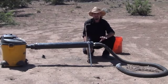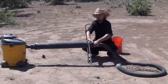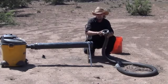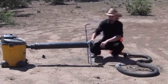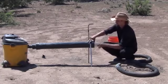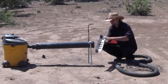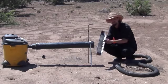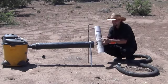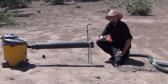I'll bring you up close and show you what it looks like up close. First thing you're going to want to do is remove your dredge hose — you just twist the whole system here, it pulls the whole end cap out of the 4-inch PVC. That's a threaded PVC 4-inch end cap hooked right to your dredge hose. The first part of the sluice box you pull out is your nugget check, and that's going to be this piece right here.